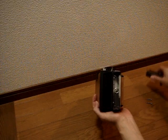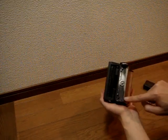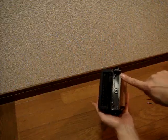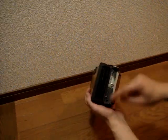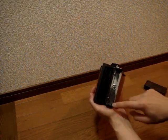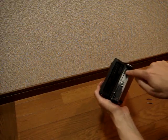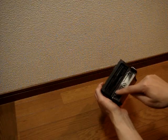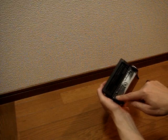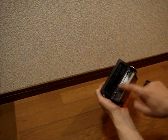When you actually shape a grip, there are a few things you have to do. First is this channel — there's a kind of ridge running along the front edge of the body and you have to carve out a chunk of your grip so that it will clear this edge. There are also these nipple bits here; you'll need to drill a hole or carve out the chunk to clear these as well. These were for the pivot and one of the screws for the end plate that was here before to hold the latch in.